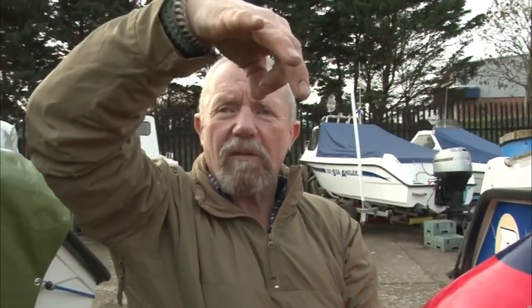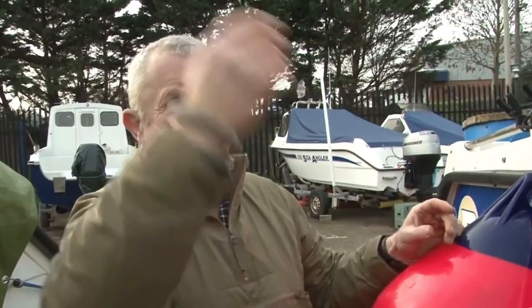The buoy lifts the anchor off the bottom and the chain that the anchor is attached to the anchor warp by is heavier than the anchor. And so once it's pulled up and pulled through that metal ring, the anchor just hangs underneath the buoy. And then it's an easy thing, just cut the engine, turn sideways onto it and just retrieve the rope.